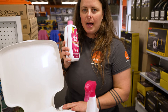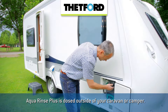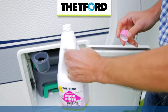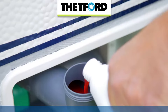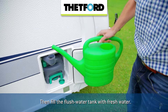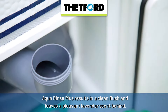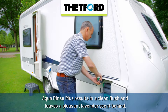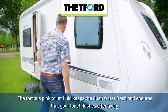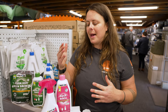So you're going to get a lot more length of time out of your flush tank. The rate of application for your concentrate is around about 50 mils per 15 litre flush tank capacity. The 15 litre flush tank capacity is quite common, whereas if you have a 10 litre capacity, you're obviously going to reduce that down to around about 30 mils. When you're using your concentrate, you're going to be adding it into your flush tank. It's best done when your flush tank is empty — you pop your dose of concentrate in, and then you fill it up with water. Each time you dose up your tank, it's just a matter of when that flush water runs straight out. You don't need to keep it topped up over a period of time at all.